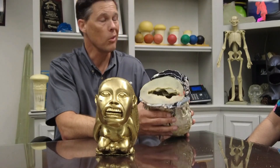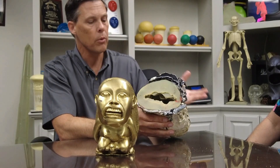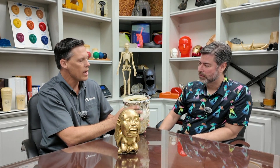It's almost like it adds a layer of protection — almost like PVA when you do wax and PVA — without having to go to that extreme. As for whether to do a solid cast or a slush cast, again we want to think about exotherm and heat. I'd probably slush cast or rotocast this if you can. You could get a good layer in there and then backfill with something — even foam, but I probably wouldn't do foam expansion. I just wouldn't pour a big giant solid slug in there; I'd be afraid it would build a lot of heat and stick.